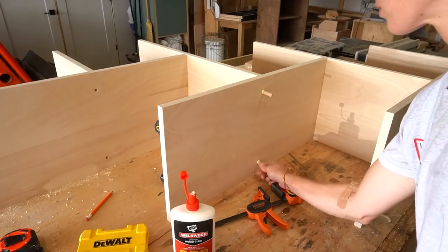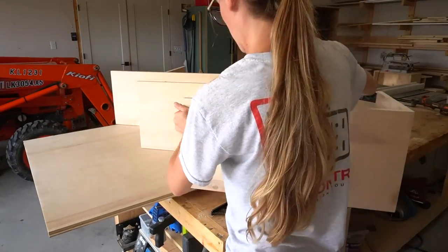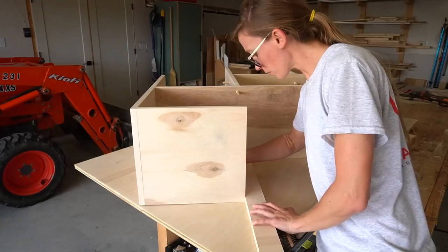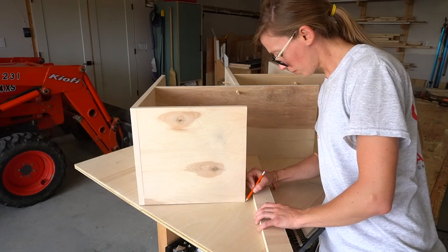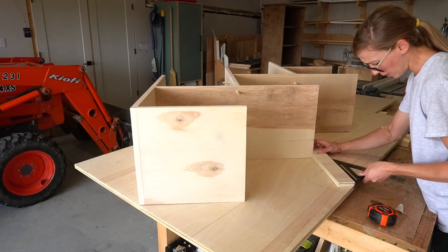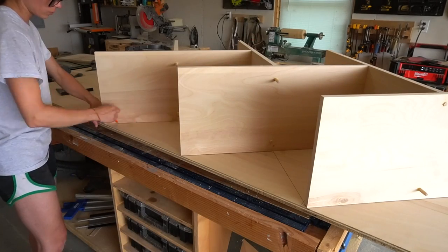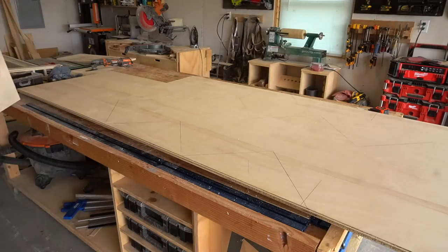Once the entire shelf section was together I placed the remaining plywood sheet on my workbench and laid the shelf assembly on top. I lined up the bottom corner and the left side against the edge of the sheet, checked that it was straight and square, then traced out where it needed to be cut for the back panel. I used a straight edge and speed square to make sure the tracing stayed square. One note: I lined up the bottom edge of the shelf with the bottom edge of the plywood, but I actually meant to leave a 3/4 inch space there so the base plate would butt up to the back panel later — I forgot to leave that extra 3/4 inch length on the back panel.